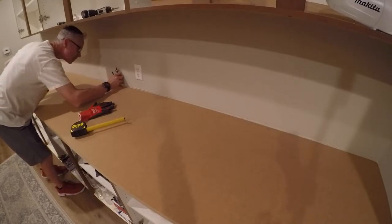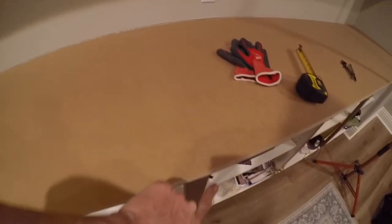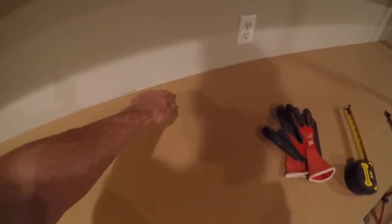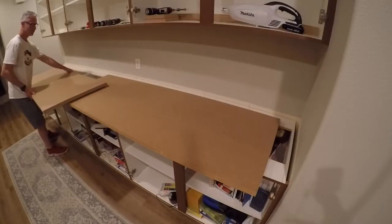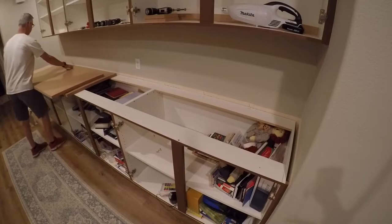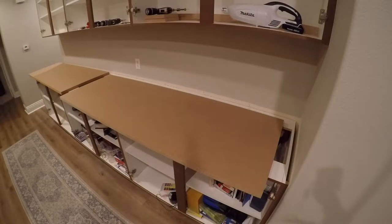When you're done marking, you can separate the two pieces and trim everything off. It's neat to look at the wall, look at the line, and look at the wall after you're done marking — it's just absolutely crazy how crooked this wall is, but it doesn't surprise me. This is over 12 feet long. I'm showing you the joint to make sure it's flush at the front — very important that these pieces are flush and tight up against each other when you scribe, otherwise when you put them together they're not going to fit right.